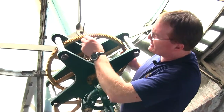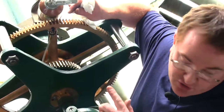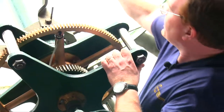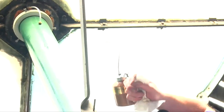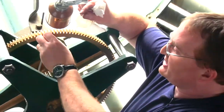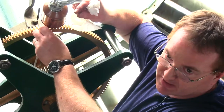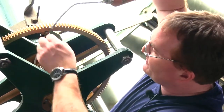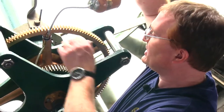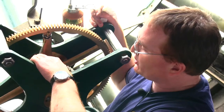Up top on this gear — and it can be in any position because this gear is constantly turning — there's an oil tube up here and one down here at the end as well. What you do is unscrew the cap off of it — same fitting as you find on your tires. Take the cap off; don't lose it, because you want to keep any foreign particles from getting in there. Take the oil and pump oil in there — you're going to see it go through the tube and fill the tube up. Usually I pull the oiler right out and let this drain all the oil into it.